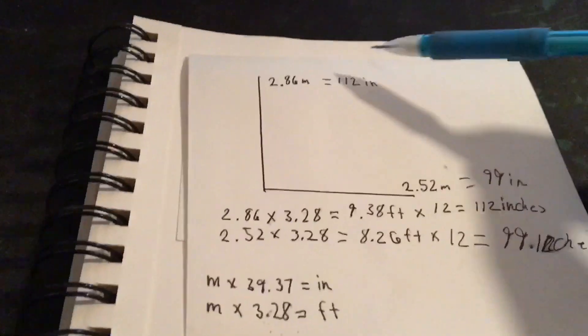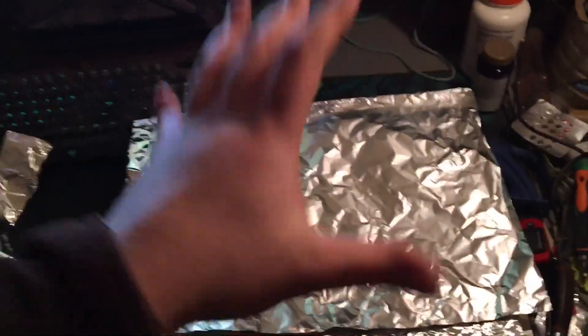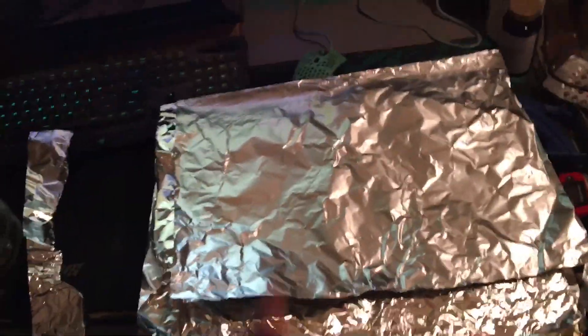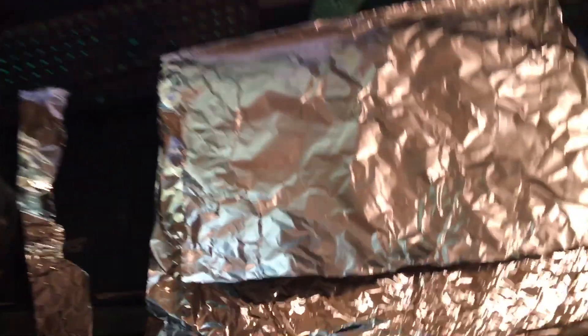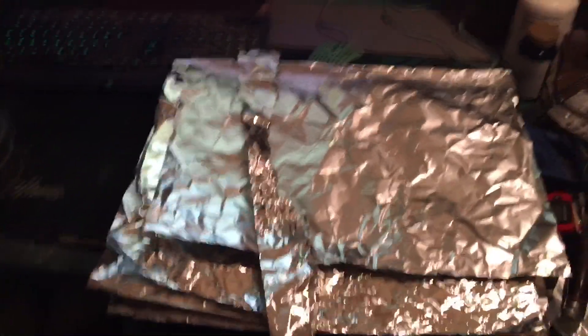Easy stuff — 112 and 99 inches. Let's go get it built and see what we get. It's probably not going to be exactly like this; we may make it a little longer or shorter depending on the ground we're over and what's nearby. This piece of foil is a little longer than 112 inches — we're going to divide it down the middle and trim to resonance. Remember you have a little bit of length in the clips and the coaxial cable itself. If you don't have a measuring tape, the aluminum foil box tells you the width — this is 18 inches. So 112 divided by 18 is about 6.22 — run it six times down the length then go another half width, clip it there, and trim down to the lowest SWR.